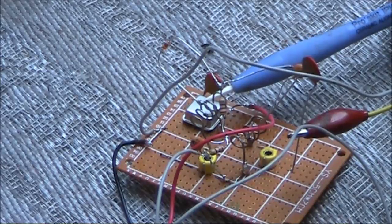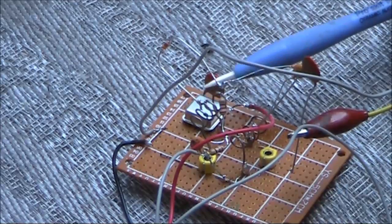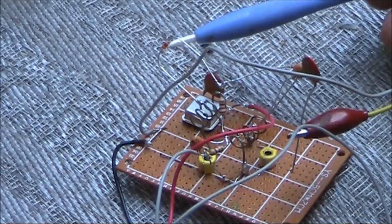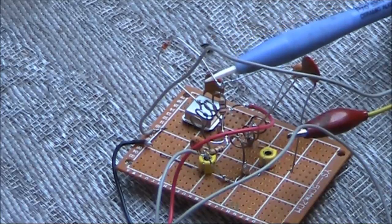There are a few things you need. One is a portable TV. Secondly, you need a camera or some sort of video source. The transmitter comprises the crystal oscillator module at the same frequency as used on 2 metres — 16.381 MHz — a tuned circuit, and a diode whose leads are embarrassingly long. It's just an ordinary 1N4148 that forms the modulator.